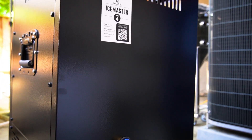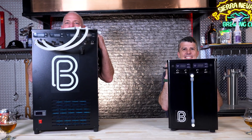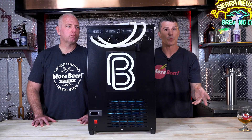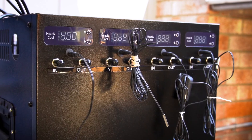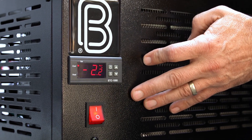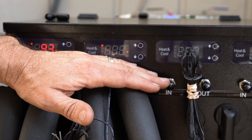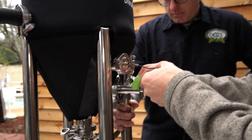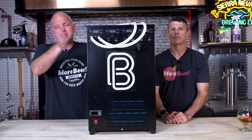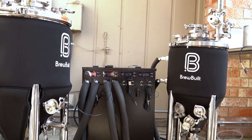We're going to start with the Ice Master Max 4 because it basically represents all three models. We have an Ice Master Max 2, which is just its little brother — very convenient, and they share the basic functionality. The only real difference between them is their size and the fact of two controllers versus four controllers. It's as simple as setting what temperature you want your fermentation at, hooking up your glycol lines, and having your temp sensor run to them. Each of your fermenters will have a thermal well; you could have one cold crashing and one controlling fermentation temperature. The big difference is how many tanks you want to cool: the Max 4 handles four, the Max 2 handles two, and the Max 100 supports up to four but lets you build out as you go.